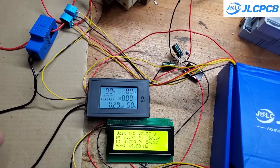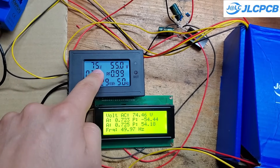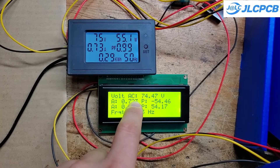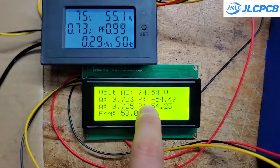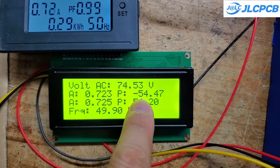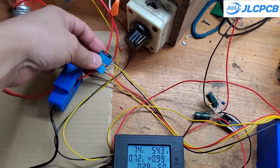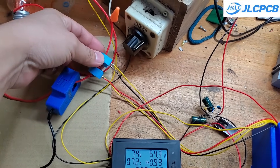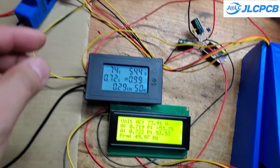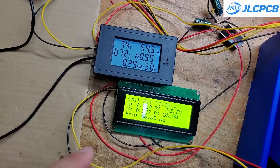You can see that the current and voltage values are quite similar across the measuring devices. The error between the meters is negligible. The sampling rate is also quite fast, about 200 milliseconds per sample. The display will show one positive and one negative power value, because we have oriented the two current sensors in opposite directions. This module can simultaneously measure power in both directions.